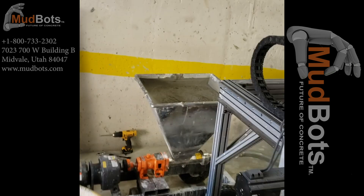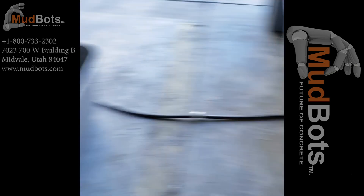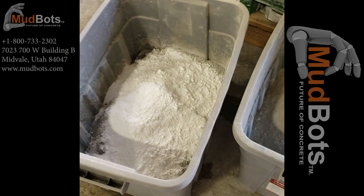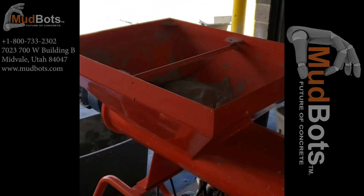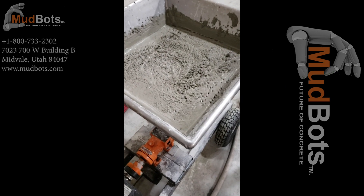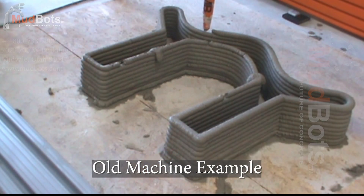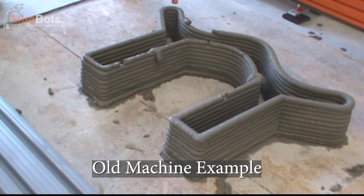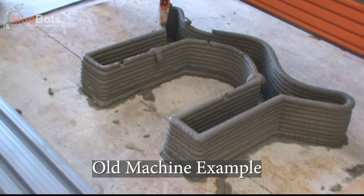On smaller jobs, there's a lot of cleanup, so you might elect to just work from the bags and mix it by hand or use a standard cement mixer to get your powder evenly mixed before loading the hopper. When you're filling your hopper, you want to keep it right up to the top. If you let it get more than half empty, you lose the weight that helps bring the mix down into the auger and into the hose. Have your mix ready at all times, otherwise you're going to end up getting air in the line.